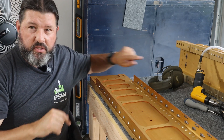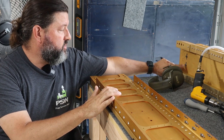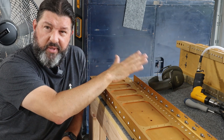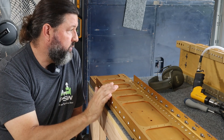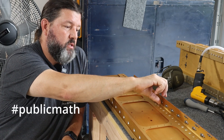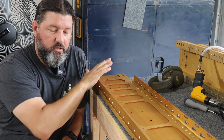There are more — these two right here are at the center section of the spar, where it's attached to the airplane, and these two will eventually be attached to vertical bars inside the fuselage assembly. That's four more, so about 148 plate nuts total. To do 148 plate nuts you have to drill three countersunk holes for every plate nut — so around 360 countersinks for these plus another 48 for the others, roughly 400-plus countersinks total, and they don't go quickly.